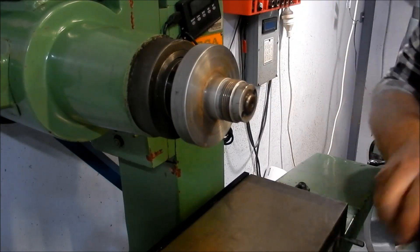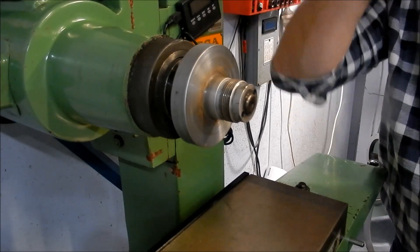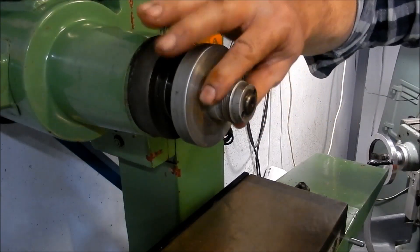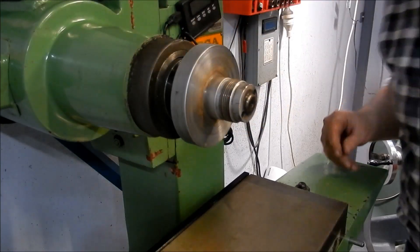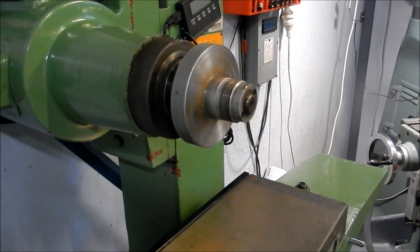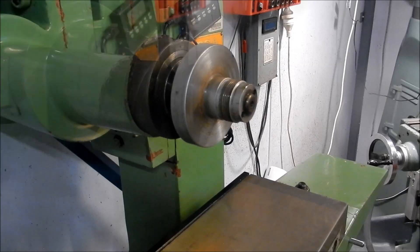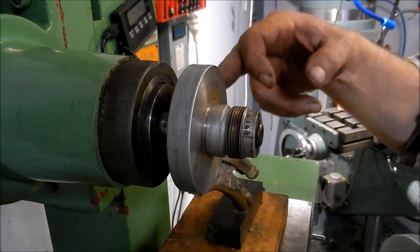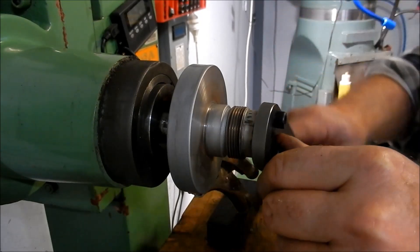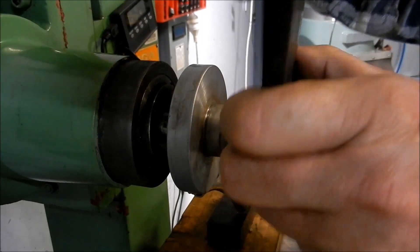I might have to put a pair of vice grips in here. I don't want to but it may be the only choice I've got to try and get this thing released. A little bit of heat on it — it's not hot hot but there's a bit of heat in there. Something you don't like to do, but sometimes you're forced into those particular positions. So we'll get set up with some vice grips and get them clamped on here. I'll wrap some emery tape around that to try to afford some protection. Alright guys, I've had to give it another two heatings. I've had to put the clamp directly on the shaft — it just kept slipping on the emery, it was doing no good at all. I've given it a fair old whack and tap, and it is now coming loose.